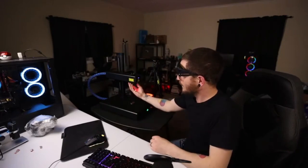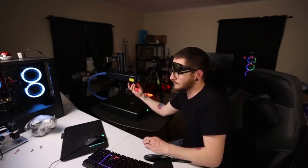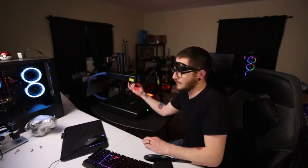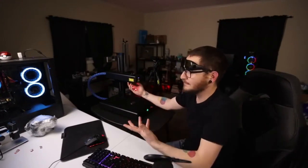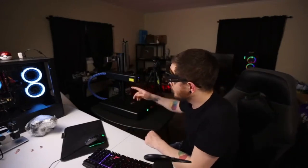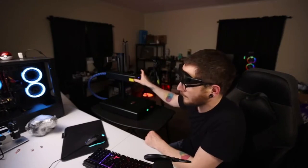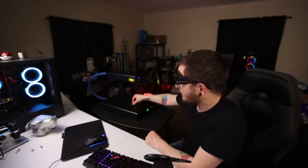I'm assuming this isn't a 10mm mirror setup, so we probably have a slightly larger dot size on a laser like this. Maybe 3P Lasers can answer this for us. I don't know what kind of expander you guys are using, Night JMac, or what the technical head size is on this. Our Mactron takes a 10mm head, so we can spit out a much thicker beam. And that means that once it passes through our f-theta lens, we're going to get a smaller dot size. There's no way they're fitting that 10mm setup inside of this bar. I just don't buy it. So we're probably getting a bigger dot size on something like this, too.